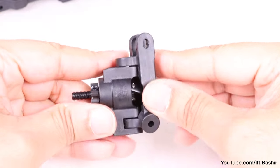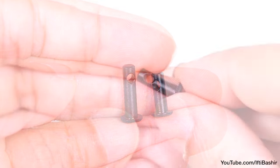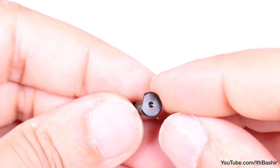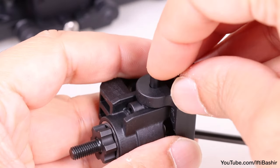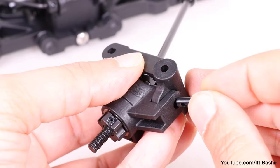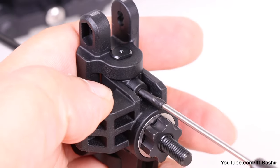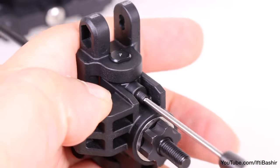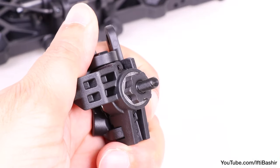Secure with a pin from top and bottom. You'll find two lengths in the kit, both of which have a hole in the end that lines up with the flat edge on the screw head. The shorter pin goes up top with the flat edge facing outwards and the longer pin down below, again with the flat edge facing outwards, so that a 12mm screw pin can be installed and lock the pins into place. Going into plastic here, so no thread lock required.